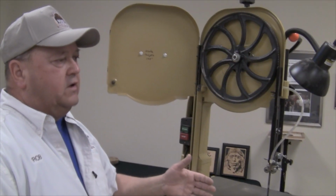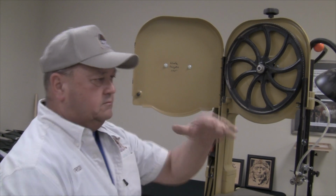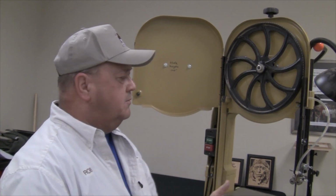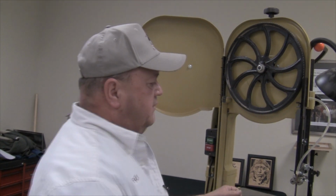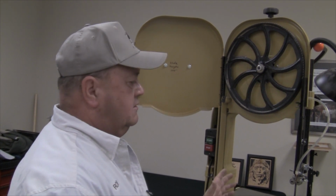Now the thing is, when I'm cutting logs with that, you're going straight across the log and it is straight. But after you cut it down, you've got a half a log, and you're trying to turn it into a bowl blank, you're maneuvering something that's sometimes 50, 60 pounds, and I try to get square cuts off of it, not trying to round it. If I'm using a 3/4 inch blade, I try to get it straight too. But you are messing up a little bit if you turn it on there, so you just avoid it whenever you can.